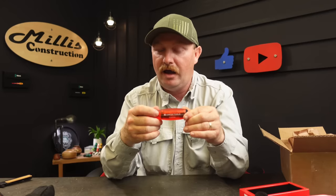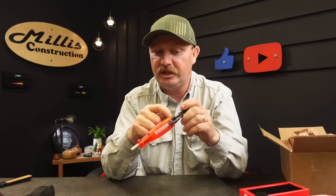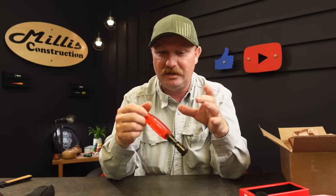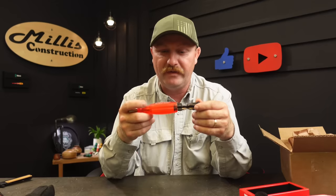That's a nice selection of Torx, Phillips, and slotted, which makes it a perfect setup. I imagine they have a Pozi version as well but for me Phillips is where it's at. What I end up doing is pulling out a couple of the slotted bits and putting in more sizes I use — for instance a Torx 25, since I run into a lot of T25s. I also like to swap in security Torx bits that have the hole in the tip, because I work a lot on commercial jobs. A Torx security bit will work on both normal and security Torx, but a normal Torx won't work on security, so it gives me more flexibility. I keep bit boxes from PB Swiss in my rolling tool chest and work them in and out as needed — and I haven't actually broken a PB Swiss bit yet.